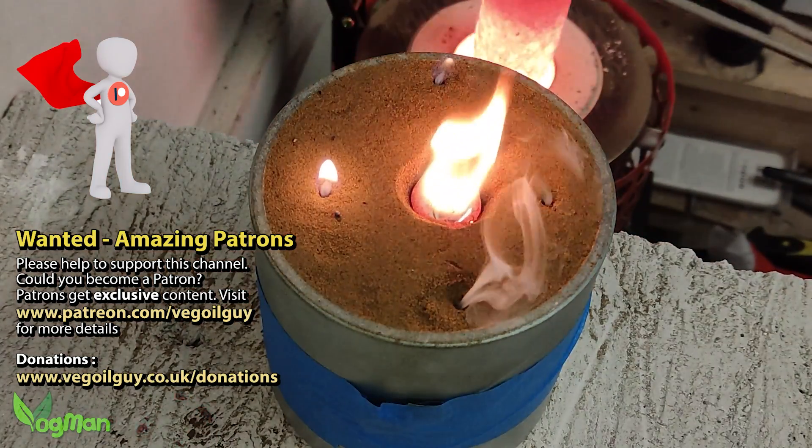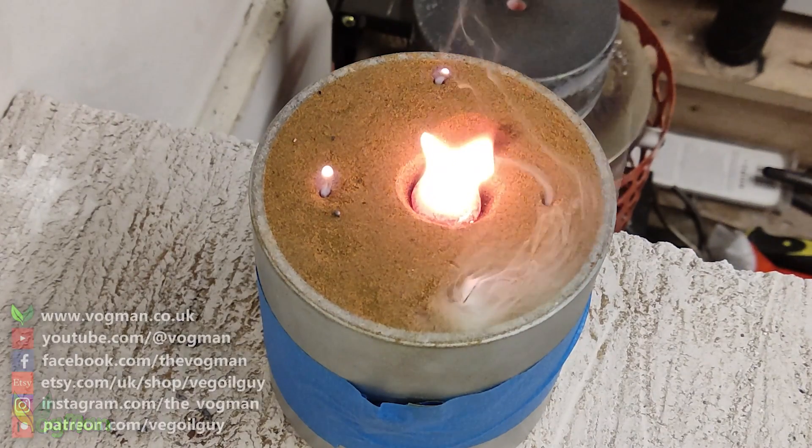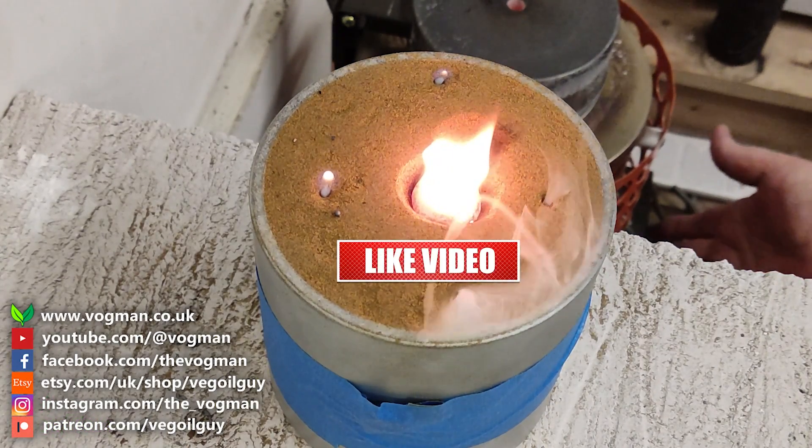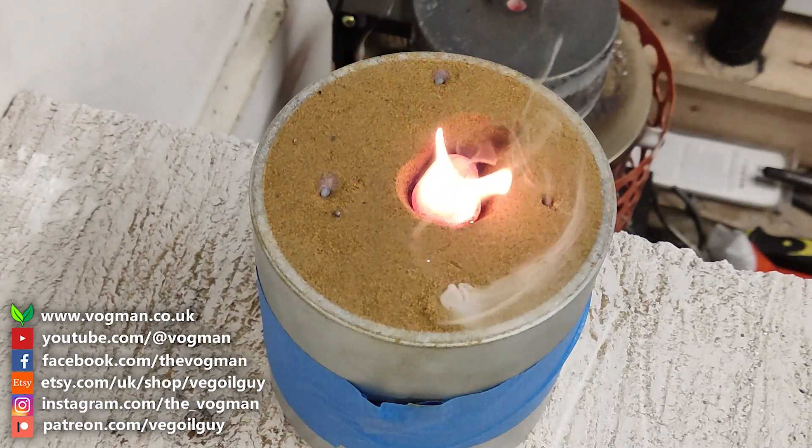I think it's fair to say that these aren't my best castings, but this technique is surprisingly simple and it's very adaptable. I've no doubt with practice I could improve things, and perhaps the choice of sand is an issue — maybe proper Delft Clay would have produced better results. In addition to being a more affordable way of metal casting, it's also very quick. Lost resin casting typically takes me two or three days, but I think 15 minutes of flask preparation and maybe 45 minutes of cooling could give you roughly a one hour turnaround, which would allow you to do a lot more casting in any one day. So I hope you enjoyed this one — it's certainly a fun, simple and affordable way to have a go at metal casting. Take care and thanks for watching.